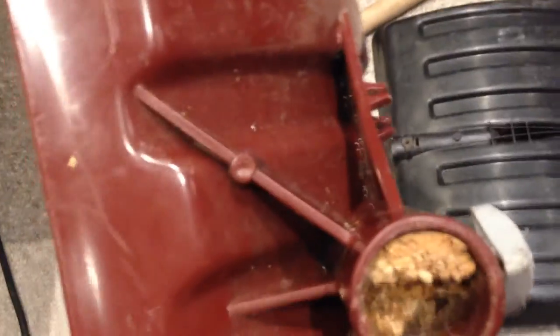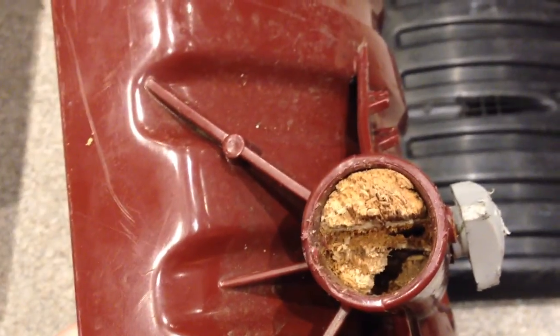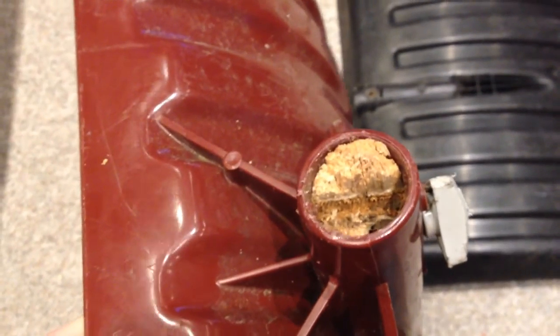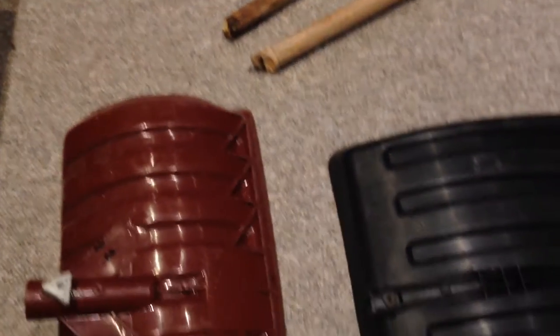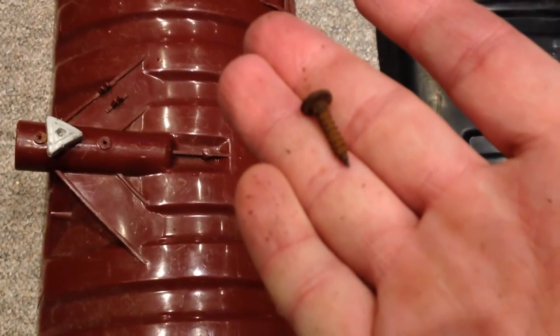What we have is a chunk of wood left inside the tool that doesn't come out as-is. To replace the handle, the socket needs to be empty so you can shape the handle and put it back on. If there are any screws in it — anywhere along — take those out first. They'll be rusty, chances are.